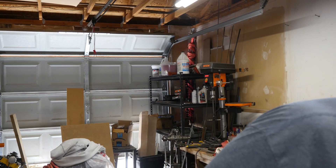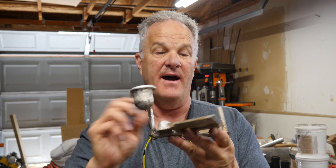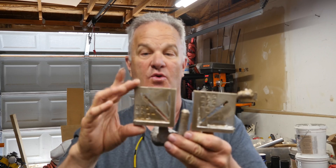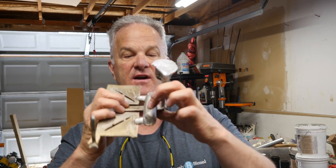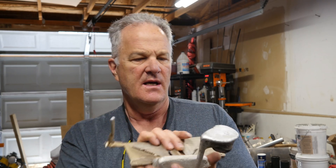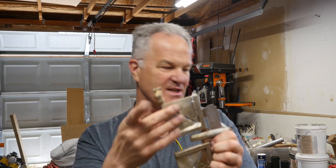The second pour I did used a taller flask. I vented it up and out this time and made it all the way to the corners — good job. I made a little bigger blind feeder. I got that funny little gas bubble in the top there. But my mold was just awful — things had fallen apart on me — and I went ahead and cast it anyway. That's where this one is.